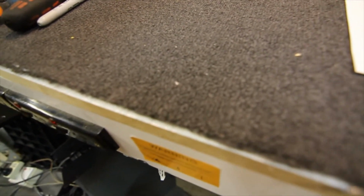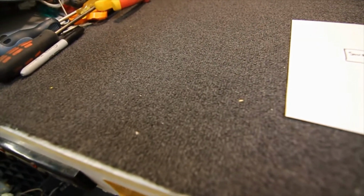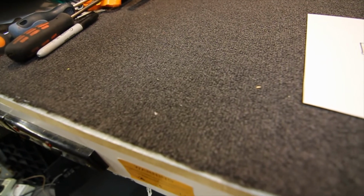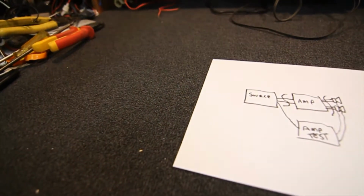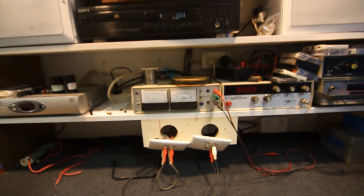And like I say, if you're going to be touching anything with the main circuitry with a soldering iron or your hands or anything, you've really got to unplug it fully these days, or you'll trip the earth leakage. There's enough voltage difference between the neutral and the earth to flick those things off.